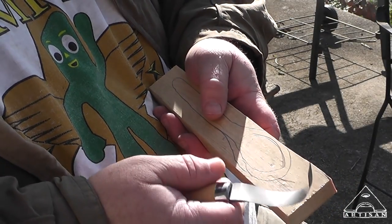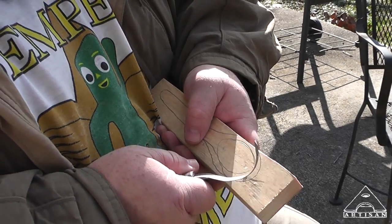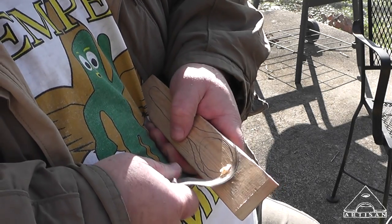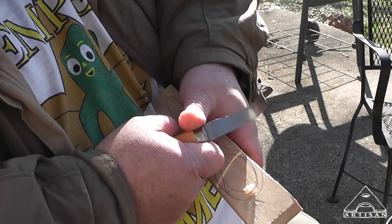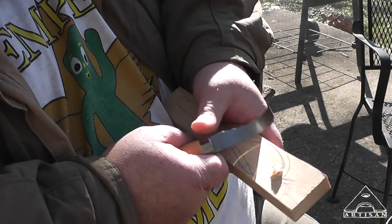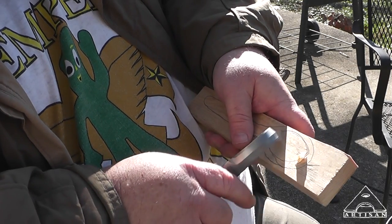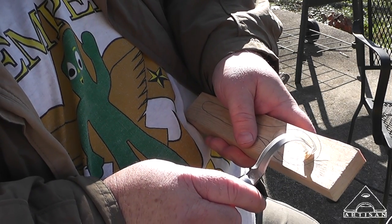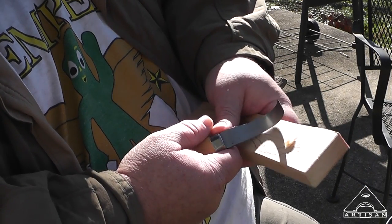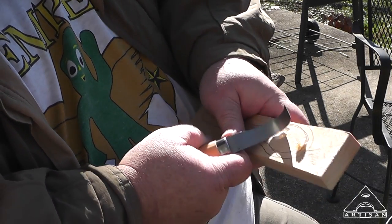With this kind of carving knife, it's not that really hard to do. You just kind of want to brace your work and start working your way around the edge. You can also do it this way — take your thumb, you just got to keep your thumb off this edge, because both of these edges are sharp. You want to get your bowl done first, because the depth of your bowl is going to control how deep the spoon is. So you want to get it down first and just work your way around.